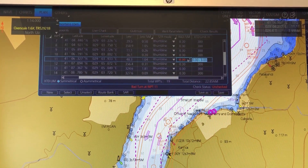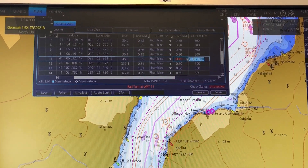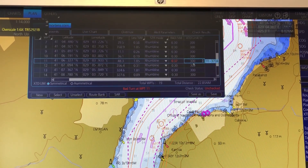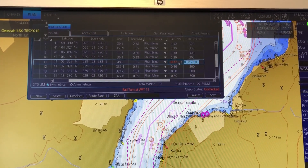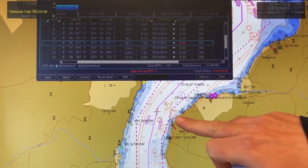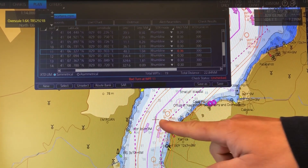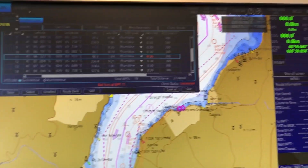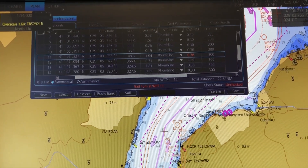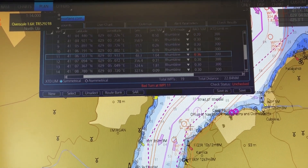The thing you can do here is try increasing the radius, but as you see I can keep increasing and nothing will dismiss this alarm. So I go down and look — one of the problems with the ECDIS is that if there is too short a distance between two waypoints, it will also give an alarm. If you have a distance less than 0.4 nautical miles, you will almost always get an alarm like this.